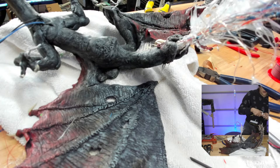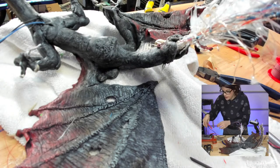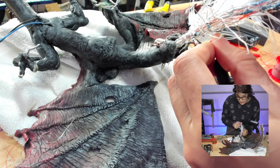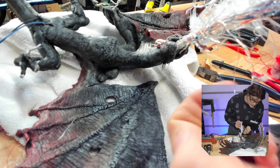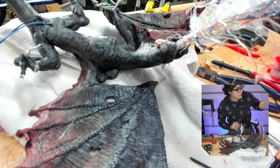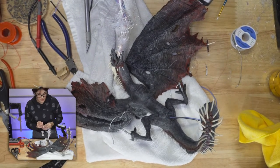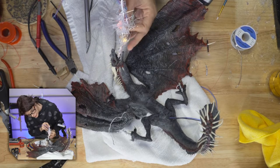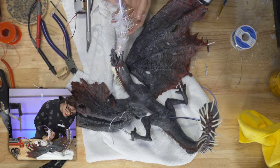Dave is saying, see if you have a short with your meter from negative to positive. Let's see. So I think I fixed the short, but we can also double check with the meter as well as the battery. All right, now we're still not getting all of them, because one of the things I noticed, once I did move our short situation, is still not all the LEDs are lighting up. So you can see that we have 1, 2, 3 LEDs lighting up, and probably better to view from the overhead view right here. And let's see if I can back you guys on out just a tiny bit. So we're going to see that we have 3 LEDs, 1 red and 2. But at this point, we should have more LEDs because we've wired up more than just the 3.